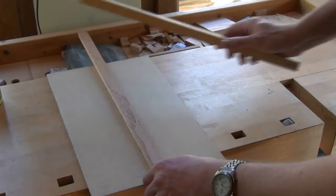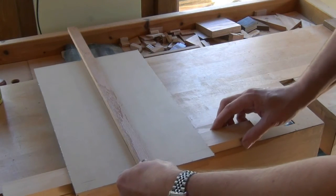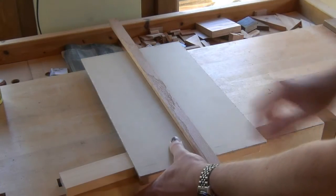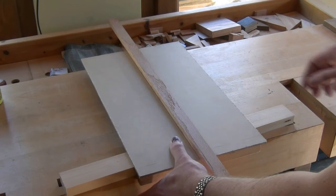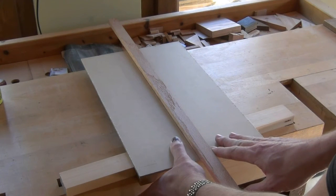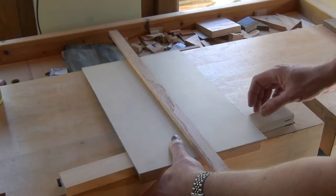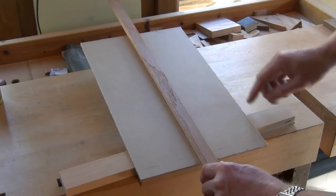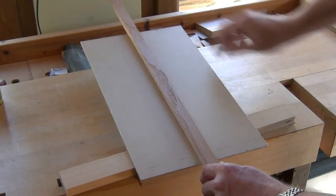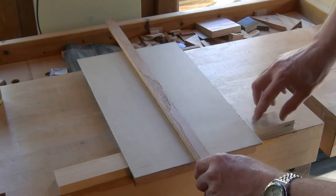The way this works — if we have a piece of wood we want to cross cut, say we want to make shoulders on it, put it up against the fence, move the edge of this board up to our mark out line, clamp the thing down to a workbench or base or something, rest the front of the circular saw on here up against the fence, start the saw and run it through against the fence. This works so well because, like rail systems, I've made a cut off the fence with the circular saw with the blade installed that I'm going to be using, and that's given me this sharp line down here which I just line up with wherever I want to cut and I'll get a perfect cut every time.